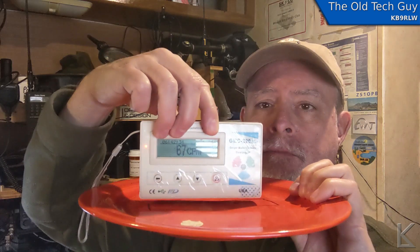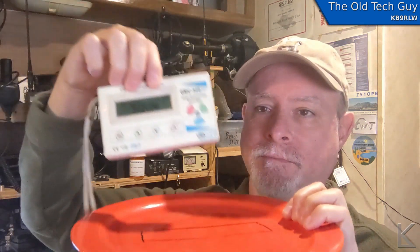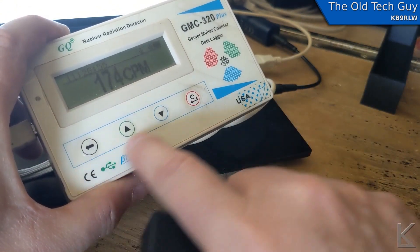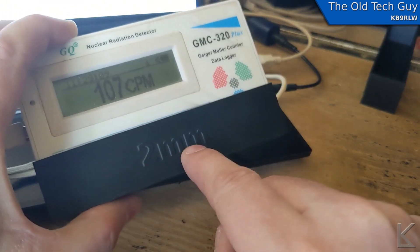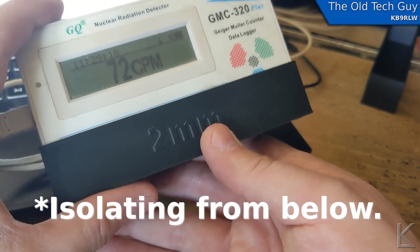Let me bring the Geiger counter up here and show you — this is fun. So that's going to be my test setup. I've got the Geiger counter, I've got the plate, and I installed the software on the laptop that reads information directly from the Geiger counter. For each of these tests, I have printed these shields. The Geiger-Müller tube is right along the bottom of the unit on the inside, and the shield will fit over the bottom of the unit like so, completely shielding the tube. The thickness of the walls and the floor is two millimeters.